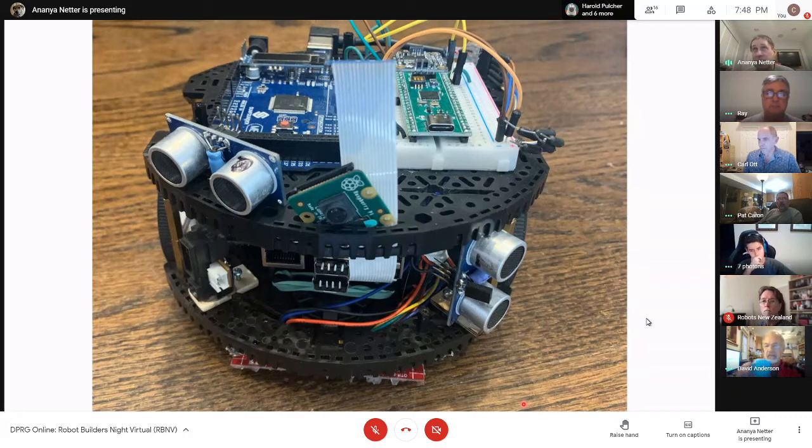I had a separate problem of not being able to talk to the BNO85. That was more of a library problem. But both problems were happening at the same time. I should have known the OLED was a suspect, because I've seen it before. Even when I have just the OLED connected and I hit reset or download new code, I've seen it before where the OLED stops working and I have to power cycle the OLED. So I should have suspected it much earlier than I did.